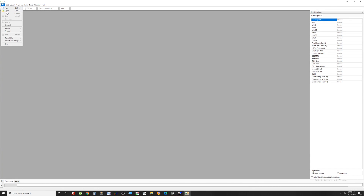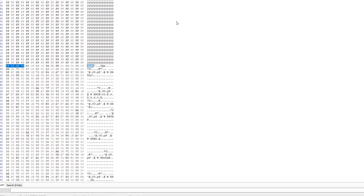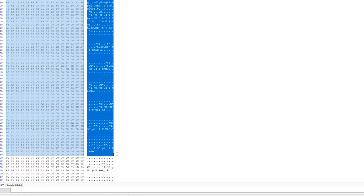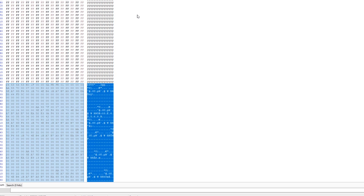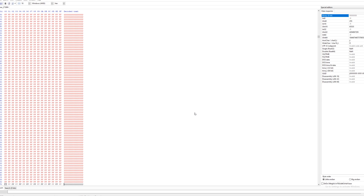We're going to open the file in a hex editor and look to see if we can locate the password. SVS — yes, right there. That's the password right here. We're going to replace it with an empty string. All this is the password, up to right over here, and it's empty like this. We're going to fill the selection with FF, which represents empty characters.